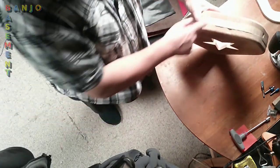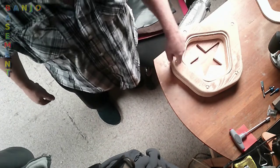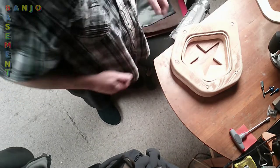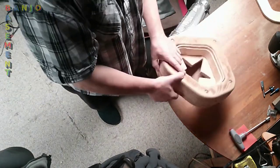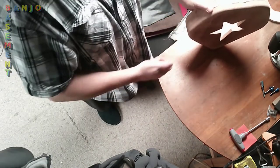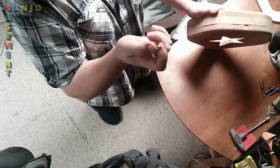The way I did it was I taped the first two together, and after I'd countersunk the heads, I went through the first two with the drill, clean through. Then I taped the bottom section to these two sections with masking tape, and set the depth to not go all the way through, and then separated the pieces.